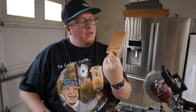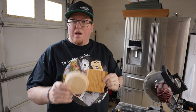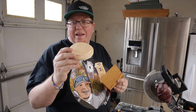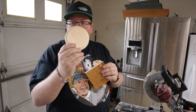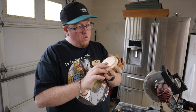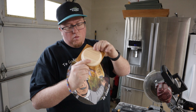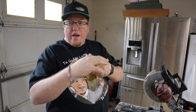I have the pieces cut out that are going to make up the discs. The template I'm using is a base that I got at Hobby Lobby — it's the perfect size, already pre-made, so it's going to work great. I'm going to tape it with double-sided stick tape right onto the top of each piece, then take my table router and route each one of these discs to the correct size.